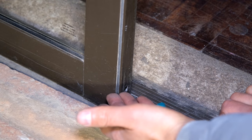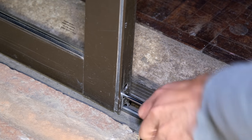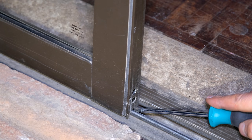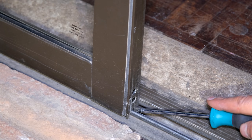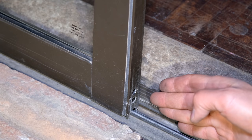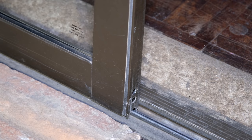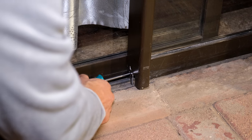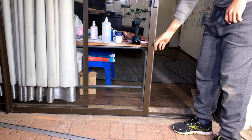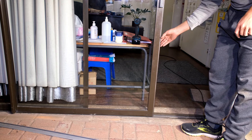It can help if someone can lift the sliding door while you're doing this exercise. That has been lifted — I don't lift it all the way, just a little bit. If you lift it too much it will have more free play. When you maintain your door you can always check this and lift it some more. Now lift the back roller as well. There's the sliding door — even if I just press on it you can see it carries on rolling nicely.